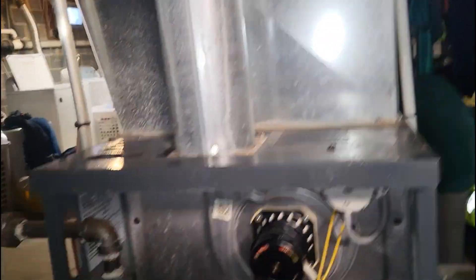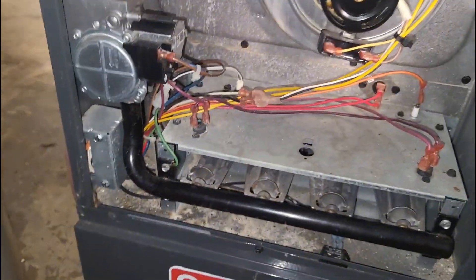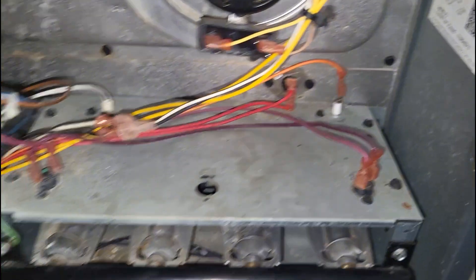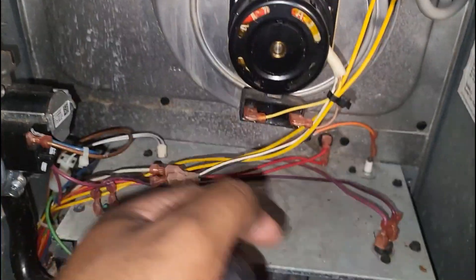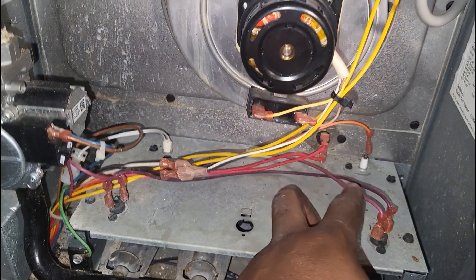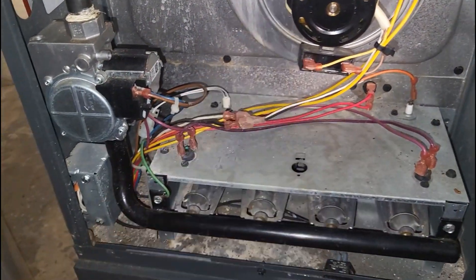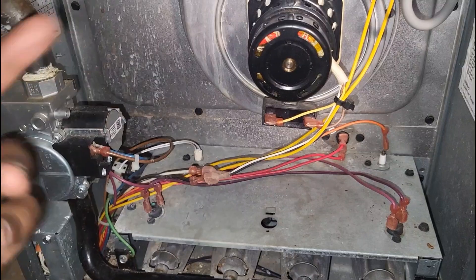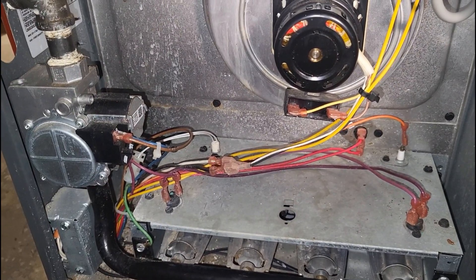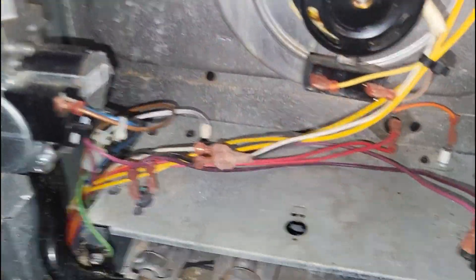This customer is now under maintenance. You can see the evap coil there — we'll come back within the next month or so to check the AC. To summarize: no heat was caused by a dirty flame sensor and the furnace was covered in dust. We popped in a new pressure switch and found the inducer motor noisy. We performed the maintenance to get the heat up and going, and we'll return to replace the inducer motor. Moving forward, maintenance will prevent future breakdowns and the customer will get a detailed report to be alerted of any sounds or abnormal electrical readings before things break down — that's the purpose of the maintenance. Avoid breakdowns and make HVAC one less thing for our customers to worry about.